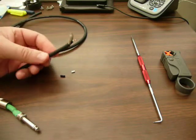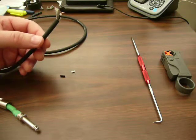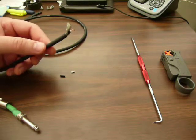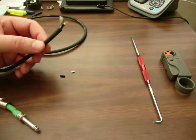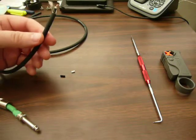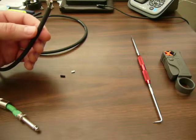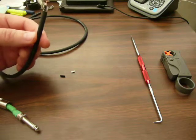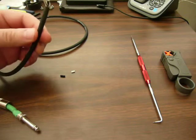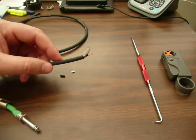What I'm showing you here is a cable from a company called GEPCO. It's X-band cable, and it's extremely low capacitance — lower capacitance than, say, Mogami 2524 cable. I've used both, so I have experience with both. I just prefer the GEPCO. I'm using such long cable lengths that the extra low capacitance really helps preserve the highs of my signal. You can't get back something you've lost through cabling, so the idea is to prevent the loss in the first place by using lower capacitance cable.